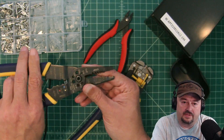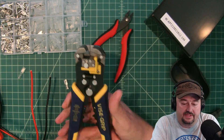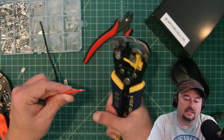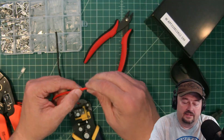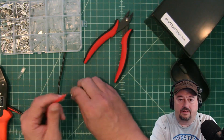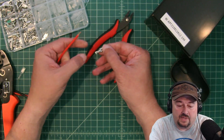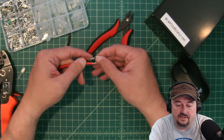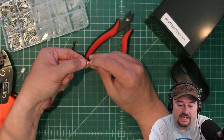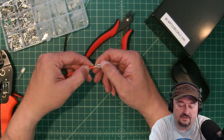We have two different kinds of strippers here — some manual wire strippers and some fancier wire strippers. I'm going to go ahead and strip this wire — there we go, that looks to be about the appropriate amount for this particular task. When we crimp these wires, this first piece holds the connector to your insulation, and then up here there's another piece that crimps down and creates what is called a physical connection to the wire itself. It looks like this goes in just about perfect.